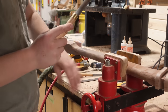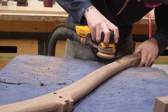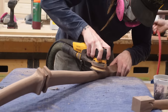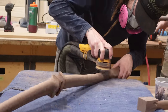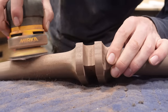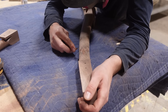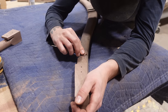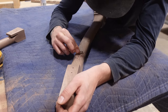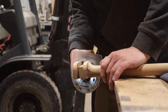This is just the beginning of this process because after the legs have been fastened to the seat there will be more imperfections to blend and tune. We bought a really nice three inch sander from Mirka specifically for this job — typically we use their six inch sanders but this job demanded such fine sanding and tight curves that it made the whole process much easier. Then we take a router to any exposed edges on the legs before fitting them together to save time afterwards.